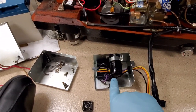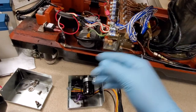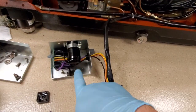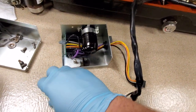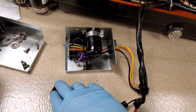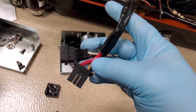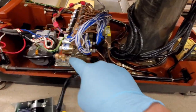So if you have bad MOSFETs, bridges, diodes, etc., they like to fail as a dead short and let the smoke out — like this right here. What I think happened is your 22 volts AC came in, shorted inside this guy, and melted all the way back. It started from here and melted all the way back to the transformer.